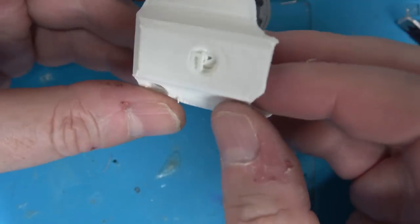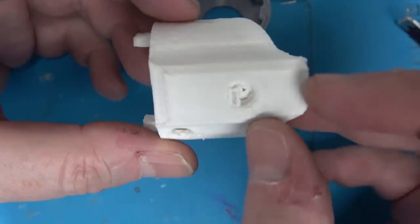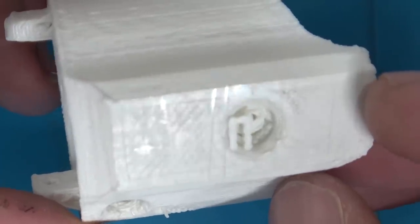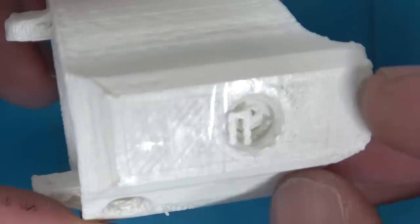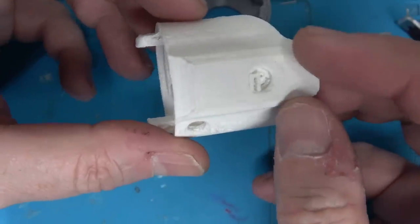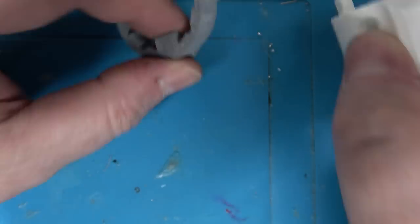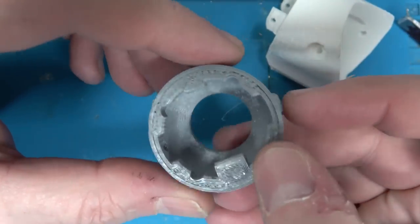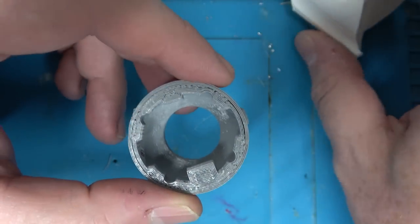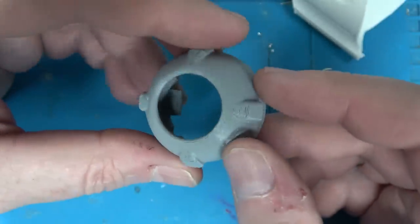This one's got like a glassy surface — it should look more like this. See how it's basically like glass, because it was on glass. You can usually see the glue stick lines in it, but it should look like a compressed piece of plastic. There shouldn't be gaps. So that was probably the only negative, despite the ringing. I'll tune up the machine when I'm moving my desk and everything, probably somewhere in the next month or so.